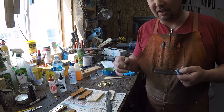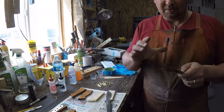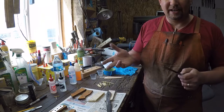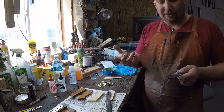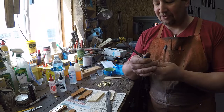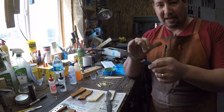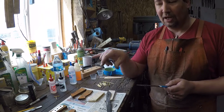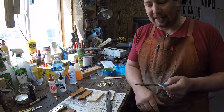If you're having problems with your epoxy bond, you can go ahead and clean it with acetone or denatured alcohol or any kind of grease remover, like a spray brake cleaner, something like that would work pretty good too. Honestly, I've never really had a problem with a mostly mechanically clean surface and these two grades of epoxy, or with something like JB Weld.